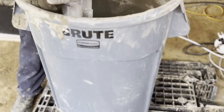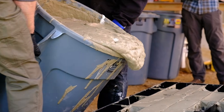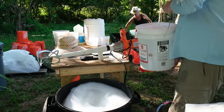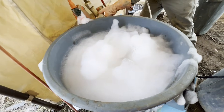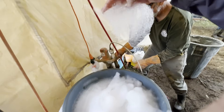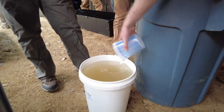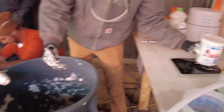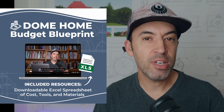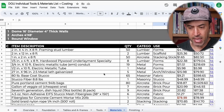You're also going to need a mixing bucket to mix the AirCrete in. We generally use a 42 or 45 gallon trash can, but you can also use a 55 gallon barrel — you want something with handles so you can pick it up and dump it into your forms. You'll also want a bucket for the foaming agent reservoir to feed the Dragon XL, which can be a five gallon bucket or something larger like a 40 or 50 gallon container if you're making a lot of AirCrete. You'll also want a few five-gallon buckets for mixing your foaming agent in batches and collecting foam during tests. You'll need a kitchen scale — an accurate one — because getting the foam to the right density is very very important. If you want to see what scale we use, sign up for the free mini course in the link in the description, where we walk through an entire spreadsheet of all the tools and materials used to build an AirCrete dome.